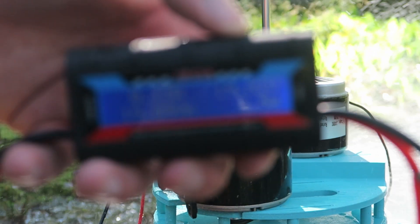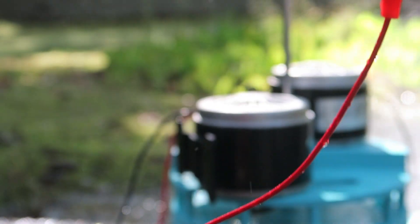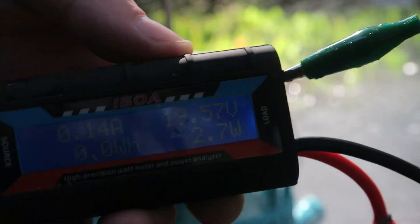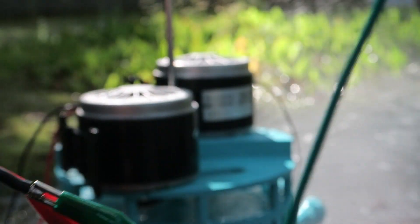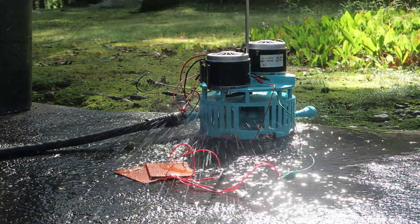Now testing the front motor to verify voltage — it has the same 20 volts, a little bit higher than the other one at 19, and the same 2.6 to 2.5 watts of power. If you notice, that's actually less than the last test videos if you've stayed up to date. I think this is likely due to the increased motor resistance from adding another one. There's still 2.5 to 2.7 watts of power draw with no load, as I was showing with the green wire lead.